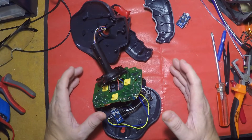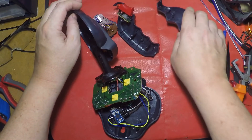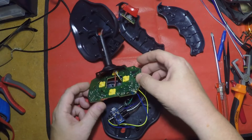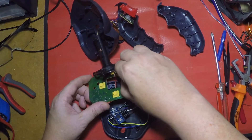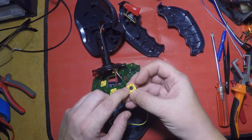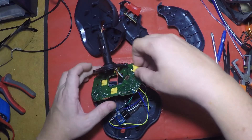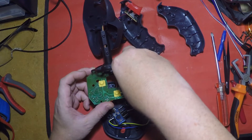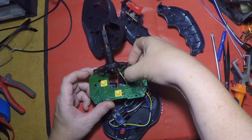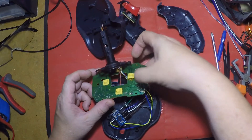This is one of them open, and I've been working on it. There are three screws to the handle itself — that comes off, and as you can see, pretty much everything is the old rubber trigger mechanism. If I take this off you'll see you've got an interleaved section of contacts here. And inside there is a contact substance of various types, which bridges, when pressed against this, bridges the contacts and makes the circuit. There were two primary methods commonly used on these kinds of things: this system and also microswitches.